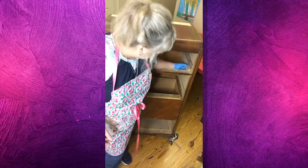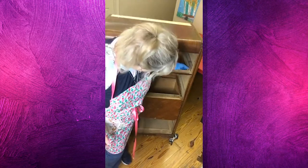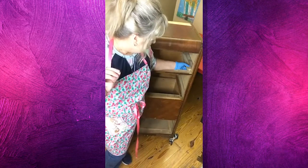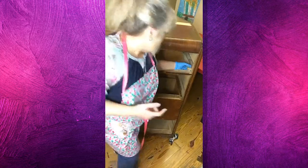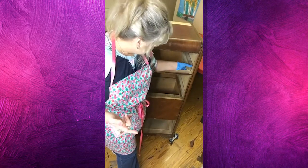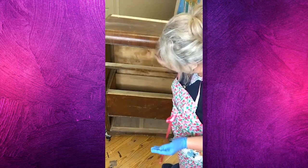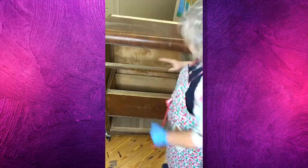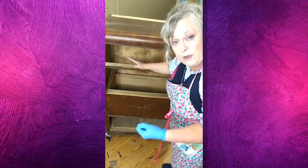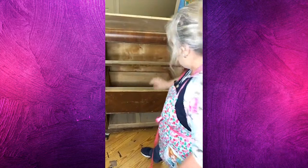Here's another piece of wood on the inside that's supposed to be fitted in there but isn't. A lot of times if your drawers aren't working right, you'll run across something like this. You can tell the last person who had this tried to repair it by putting a nail in there — there's a nail in the back on that side to make a drawer stop. What we're going to do is put what's called dead wood: a piece of wood that doesn't really connect to anything, just goes across the back to prevent the drawer from going all the way back. It can also sturdy up the dresser, and you can nail to it. So we're going to put some dead wood in the back as a drawer stop.